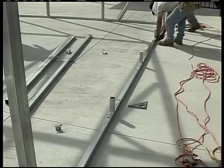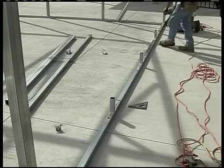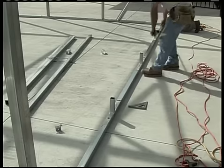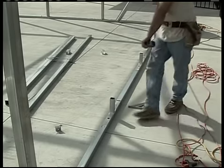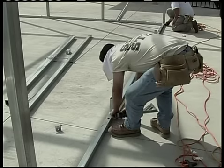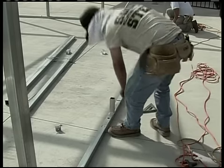The installers in this video made reference marks on the concrete that are 5 feet on center, to make sure the BE-T brackets are in the proper position. Many of our buildings will have back enclosures and verticals that are 6 feet on center.